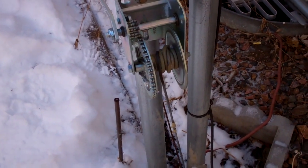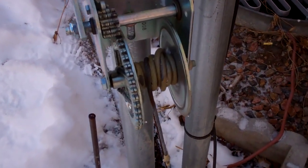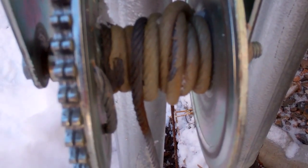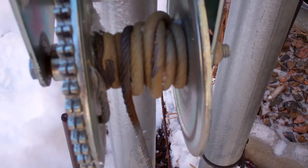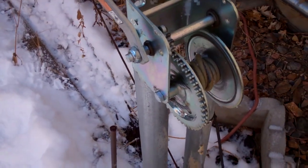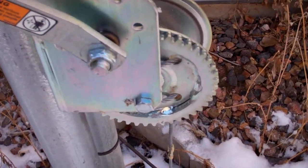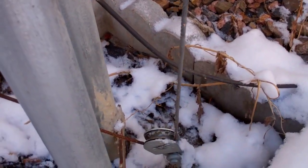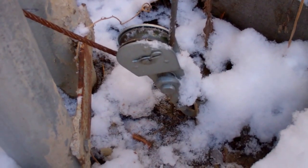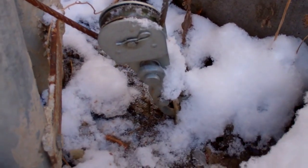The quarter-inch steel cable has a little bit of rust on it. It used to be plastic coated, but as you can see from this close-up, most of that coating has broken off — it gets brittle and wears out. I would recommend if you're going to do this, just use a galvanized steel cable to winch up the mast.